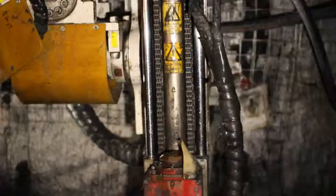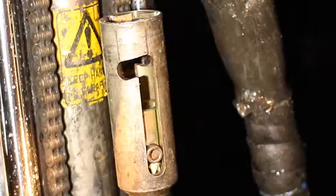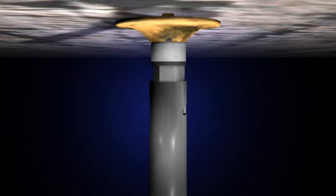Place the combo dolly in the drill rig chuck, and raise the inner hex socket of the combo dolly, and slide the lugs into the dog leg slot. The inner hex socket takes the hex drive of the Megaflex and is used to spin the bolt through the resin in much the same way as a roof bolt dolly. Place the bearing plate on top of the drill mast.